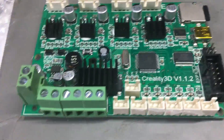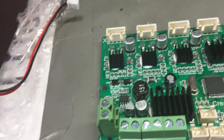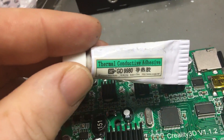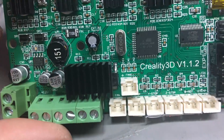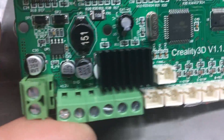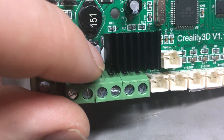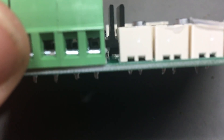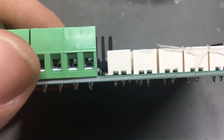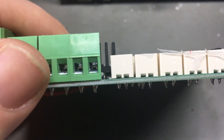The next one I was suspicious of - I actually need to glue the proper heat sink back on this. Now, the reason I'm doing the handheld, you'll see in a second - you'll see there's a MOSFET right there, only half underneath the heatsink I think. You can see the adhesive sticking on that side, that's fine. But look at the other side - you don't see any adhesive. If I bring this up, you can see the adhesive stops before the MOSFET. There's actually a gap. That end MOSFET isn't being cooled at all - there's actually a gap between it and the heat sink.